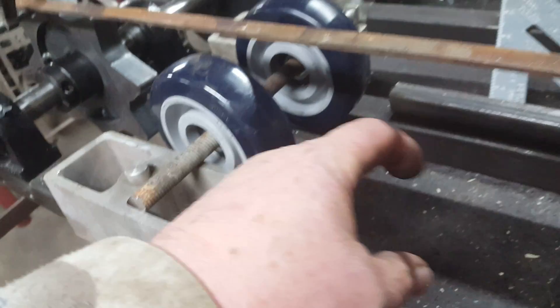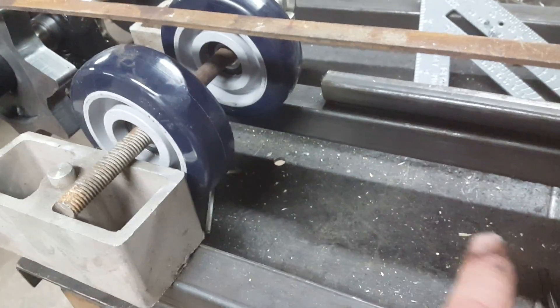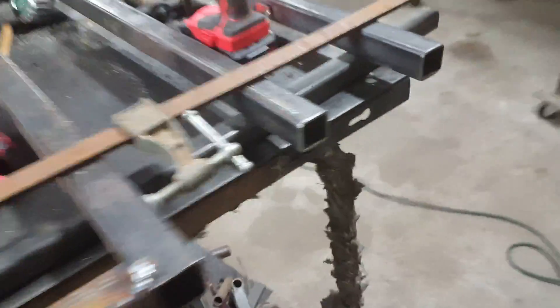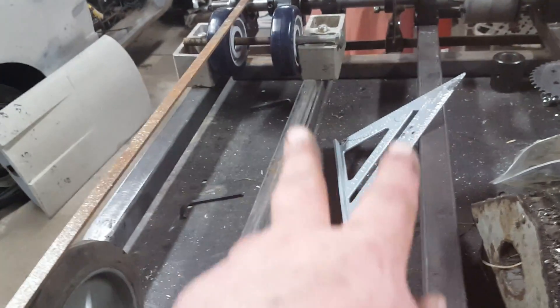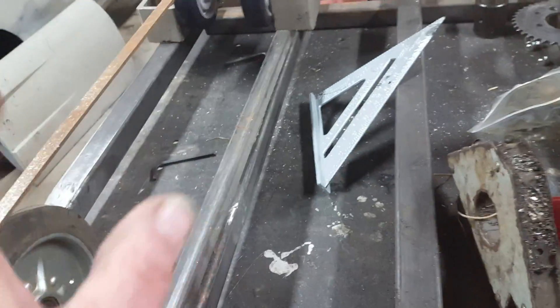So that's five inches. And if my idlers have got to drop low to match that track, then I've got to have these rails at least more than five inches. As soon as I determine that I can make my braces — let's say it's five and a half — then I can come back here; it'll be the same on the other side, of course. And then we can figure out where we're going in the center, cut the brackets and braces, and weld those in. That's how we get the basic dimension of the whole frame.